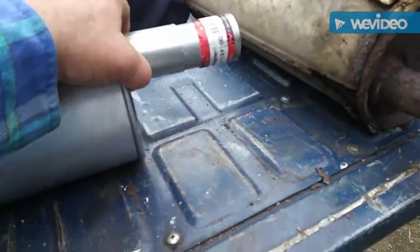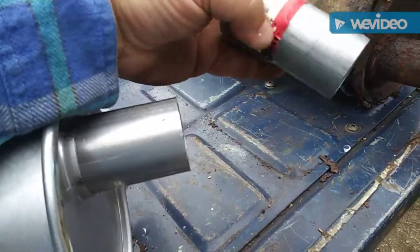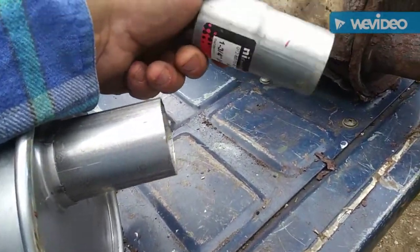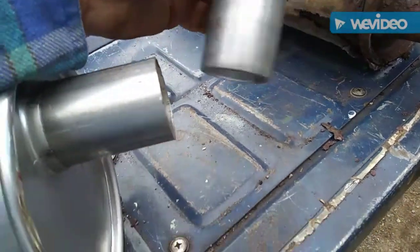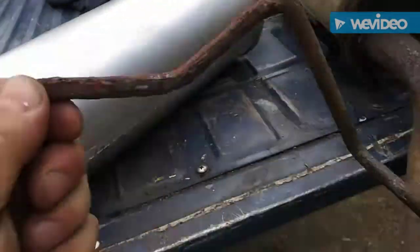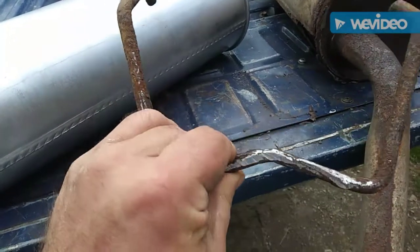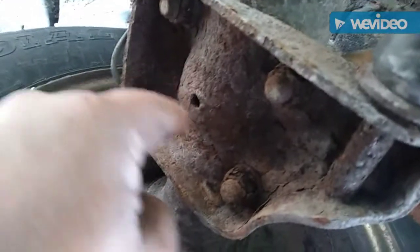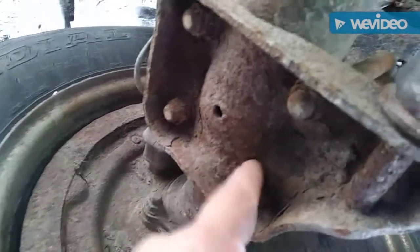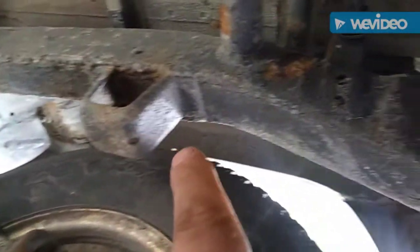I got this new one, and I've got the adapter for it right here. I'm gonna push it out about an inch, and I'll show you why. And then I have the mounting bracket — it's a little rusty, but I think I can make it work. These are supposed to unbolt, but they're all rusted. I'm gonna maybe soak that in oil, but probably have to torch them off if you ever want to change out this rear axle. And you can see also the frame has been boxed in and welded quite a bit.